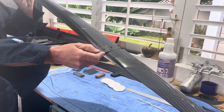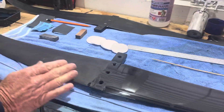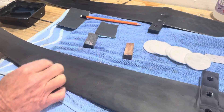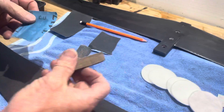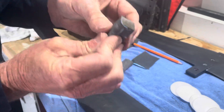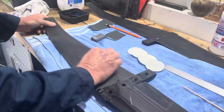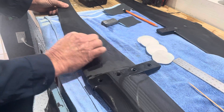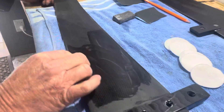This looks great, it looks fair, it looks true — I'm really happy with it. If I flip it over, I've already started working on this surface. I'm using 400 grit and two different blocks — quite small blocks — and these have become my favorite ones. It's a small cedar block that can wrap a nice little piece of wet and dry around it, keeping it tight. I dip it in water and gradually work on the Durapox surface. I'm not doing any more fairing — I've done all the shaping and removal of lumps and bumps — this is now just dealing with the surface itself.